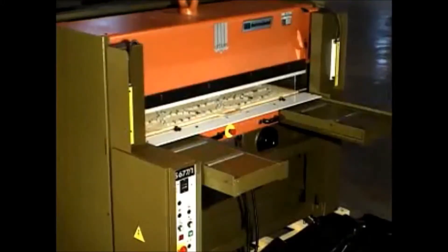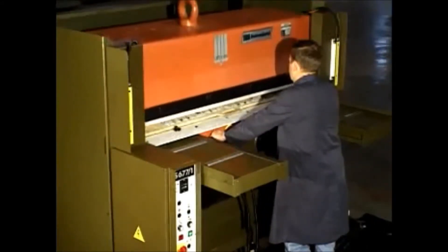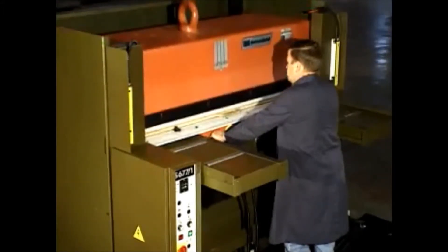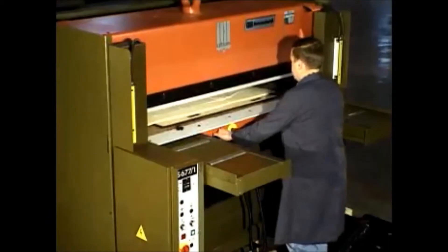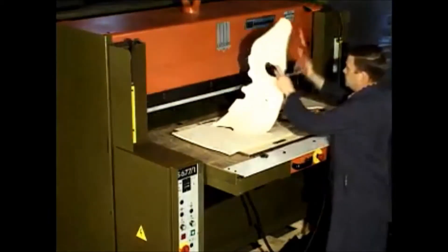Points of strength: The single cylinder hydraulic mechanism guarantees maximum parallelism and uniformity of cutting force distribution. Positive head stops for maximum cutting accuracy. The single sliding manual work tray is made of a heavy duty phenolic. The cutting die can be placed either on the tray with knives up or attached to the head of the machine with movable die clamps.